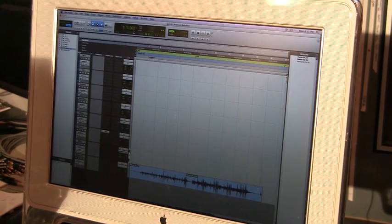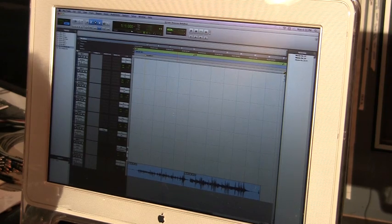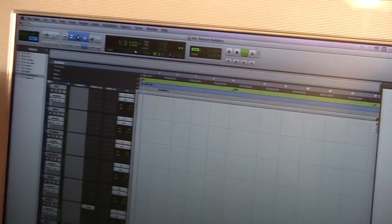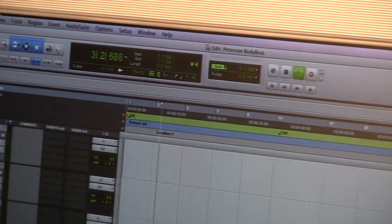Hit OK and we're ready to roll. We've set up a template with two different tempos — a two-bar count-off, then we go to 65 as the initial tempo, and then we switch to 120. We're going to see if the Body Beat is going to work well for the guys. And yes, we are making connection. Right off the bat, the click is working through the Body Beat. We're getting an audio click to the master unit, and we're going to now send a signal out to the sync units in the live room for the performers to sync up to.